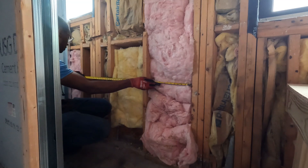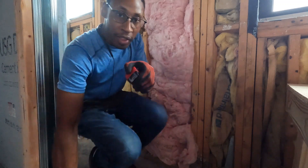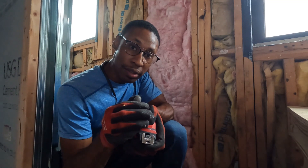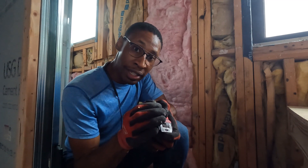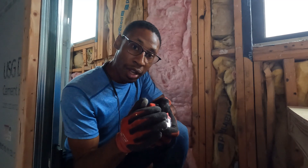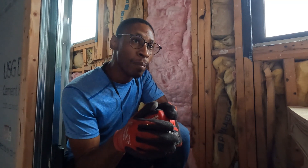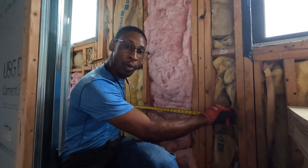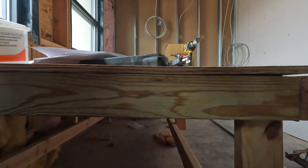Right now I'm at about 41 inches. So my measurement is 41 inches. I'm going to go to my one-inch EMT conduit and measure 41 inches. But I don't want to just bend it at 41 inches — I want to do what's called a 90-degree deduct. The deduct for 90 degrees on a one-inch conduit is going to be eight. Deduct means taking away, so we've got 41 minus 8.